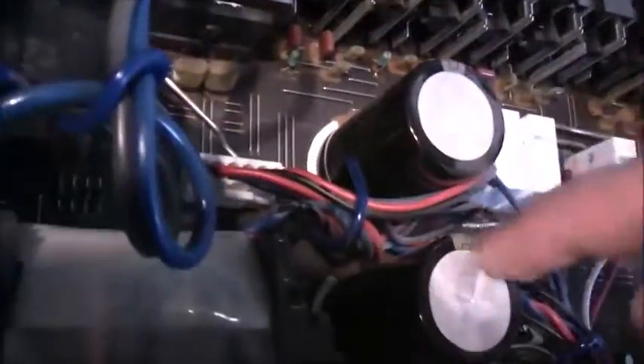I want to check that. This board is probably going to have to come out. It could be a bad solder joint on this board. This board here is what's shutting off the relay. So this usually turns on, and then two seconds later these will all come on — that's when the attached speakers come on. Yeah, it's in the power supply section. Looks like it.